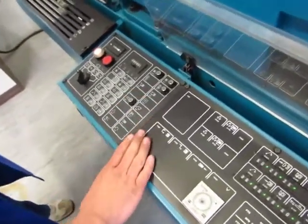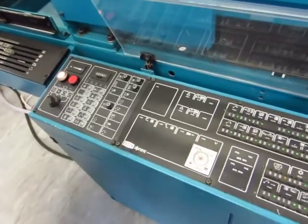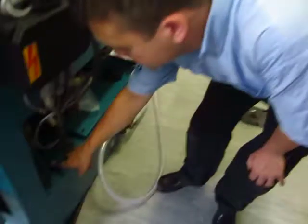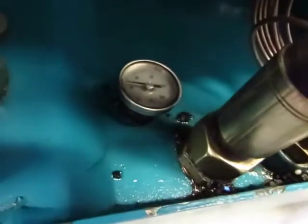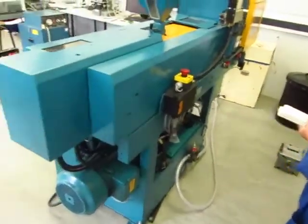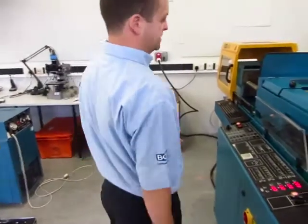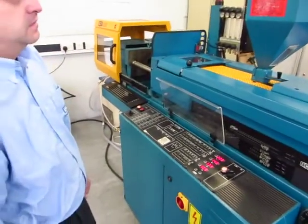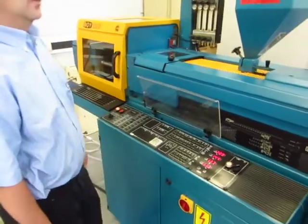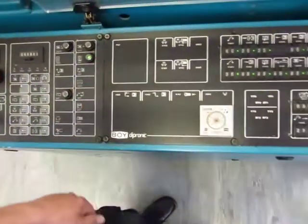The other thing that this machine's got is, they recommend the oil temperature should be about 40 degrees. Where do you read that? There should be — there we go — temperature gauge there. So that should be 40 at least? Yeah. I mean, it will warm up. Less than 40, it will warm now. But the optimum temperature, what they're saying is when you calibrate, have your 40 degrees for the viscosity of the oil. Is the optimum. And there's an oil warming switch. Let's get the oil warmer. There's an oil warming circuit. So that switch there.